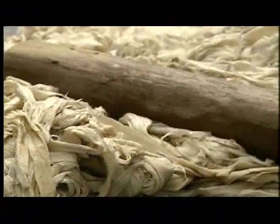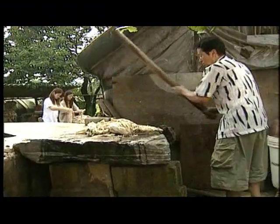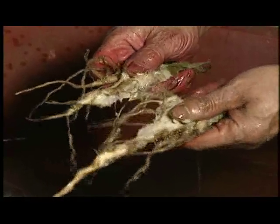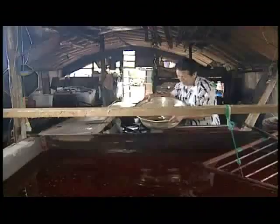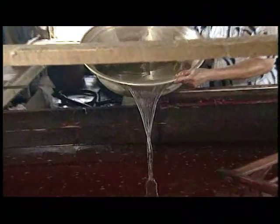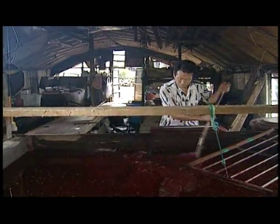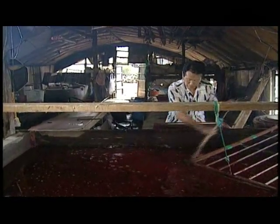After foreign substances are removed, baekdak is then beaten for the fiber to turn soft in the water. Baekdak is poured into the mold mixed with extracts from a plant called sunset hibiscus. The extract is to neutralize hanji. It is also to even the surface by spreading the fibers evenly and regulating the speed of water drainage.